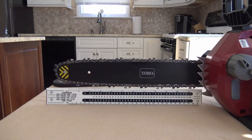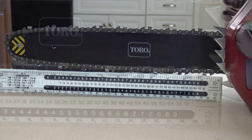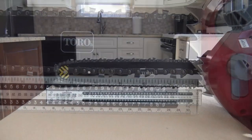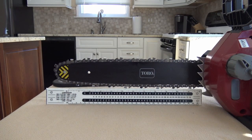The black metal piece is the guide bar that the chain goes around. The saw is for cutting tree branches and logs of a diameter no longer than the cutting length of the guide bar. Though this is a 14-inch guide bar, in reality you can't really cut a tree trunk more than 11 to 11.5 inches. If you're cutting a much larger tree, you need a bigger chainsaw. For around the house this worked for me because most of the trees I deal with have a 6 to 10 inch diameter.